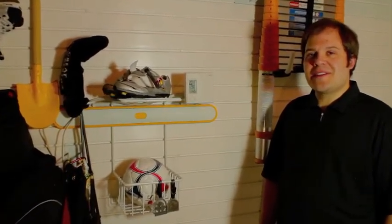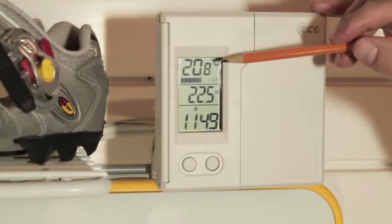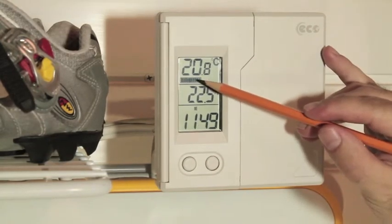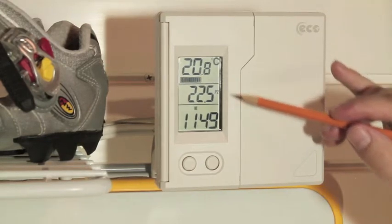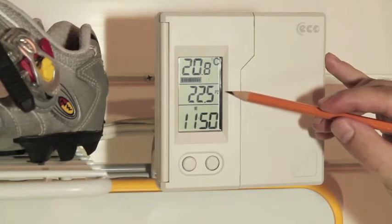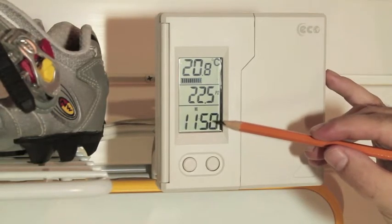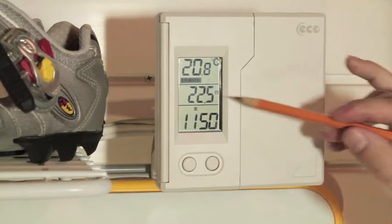By default on the M6001, you'll see two temperatures at a time. The top temperature is the actual temperature of the room. Below you'll find a power output level, and beside you'll see flames flashing when the heater is active. Beneath this you'll see the temperature you've chosen for the room, and beside you'll see the program period. At the bottom, by default, there'll be a clock displaying the actual time with two small letters above representing the day of the week.